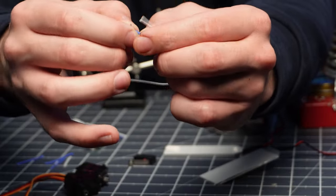I'm rarely able to get all four of the little prongs to sit onto the wire, so I'll take my pliers and slowly bend them around the wire. That way when I go to use my crimping tool, they actually bend over the wire. In the crimping tool again — you want the end that's going to be connecting to the connector exposed, because we don't want to smush that part. Keep that exposed from your crimping tool.